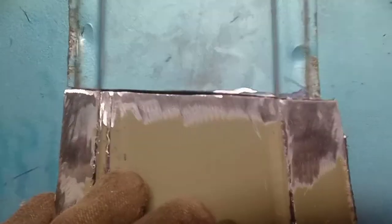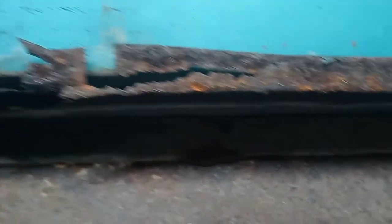So here's that panel we just made. Try and get a look at the curve we've got there — just hold it out just a hair when we weld that in. Same with this side — we just need to tip the panel out just slightly when we weld it all together. A little bit of fine fitting at the top might be necessary. Bottom seems to be basically where we want it, so when we redo this we can just draw a straight line across, and that will fix that and flange right up onto this.